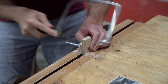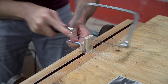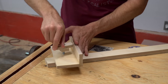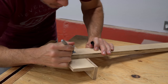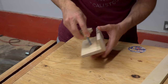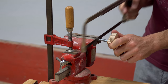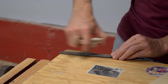I shaped the piece by hand, but if I were to do this project again, I would have left it with square corners until the disc sander portion of the job was ready. I fully threaded the knob into the miter gauge, used a sharpie to mark it, and then cut it down to size with a hacksaw.